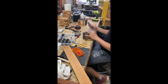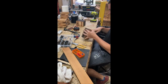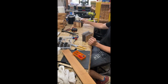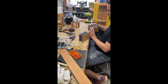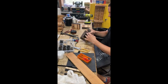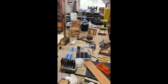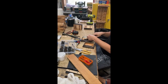Here Evan is working on one of the expression motors. Skinner uses what's called a whiffle tree motor. It has collapsing pneumatics, almost like big sandwich pneumatics, and there are 16 per motor, all hooked up in what's called a whiffle tree. They have to be cut apart and sanded down — you can see Evan's got a lot of these sanded down already. Then the rubber cloth material has to be replaced.